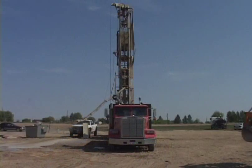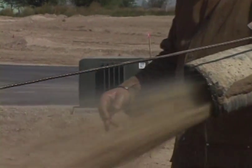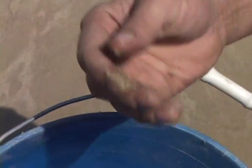Drilling produces excellent formation samples, which are returned from the bit face up the smooth annulus between the drill pipe and casing instead of a rough or eroded borehole. Samples are more accurate, small aquifers are readily detected, and ascending air velocity is easily predicted.